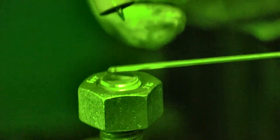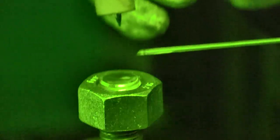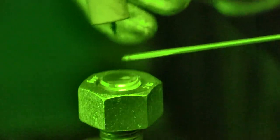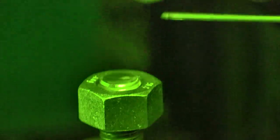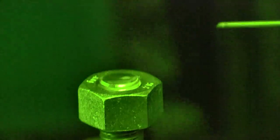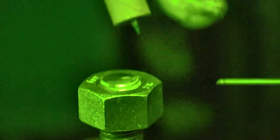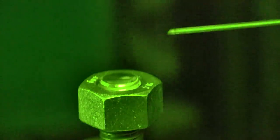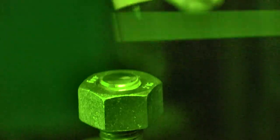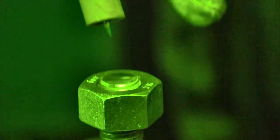Now this also has a little cadmium plating. I'm in a wide open space here, so I'm not going to be breathing this in, but I want you to see what happens. I don't know if it's going to flare up or not, and the results of it. And if there's an issue with it, then we'll clean it up and take care of it. But sometimes I have no issues, especially when I add the 308, a drop of rod here or there. Here we go.